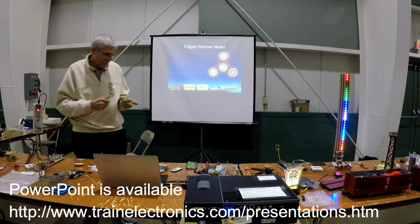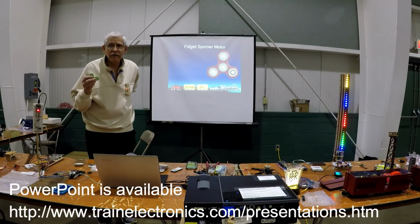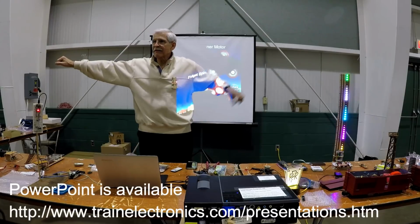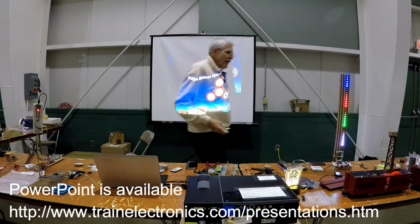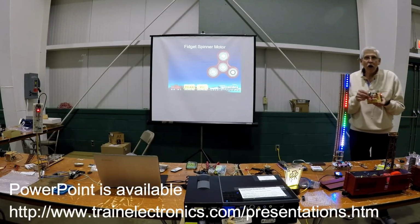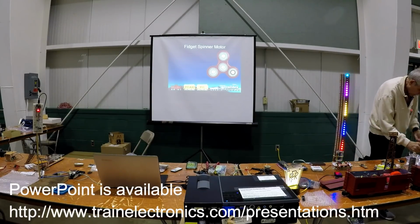But anyway, I started thinking, I was an elementary school science teacher for a number of years, almost decades. And I can remember teaching kids how a motor worked. I would have a magnet in my left and right hand and a commutator on my neck, and I did all kinds of stupid things. I said, you know what, that fidget spinner looks a little bit like the motors I used to demonstrate with the kids. So I built basically a brushless motor with a fidget spinner. There's a coil here. I put magnets on each of the fidget spinner arms, and there's a little switch over here that it hits every time it goes by. I'm not going to guarantee this is going to work, but let me see if I can fire it up.